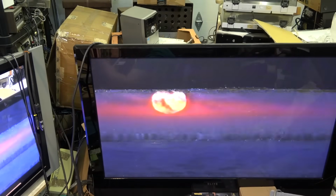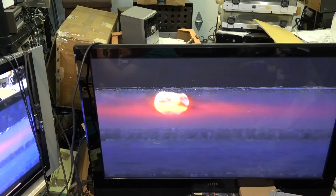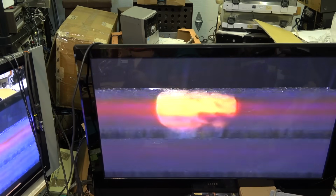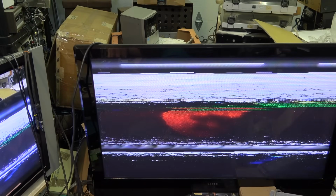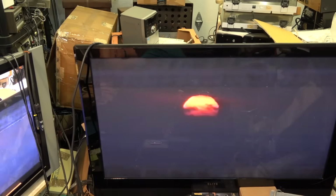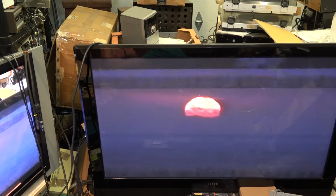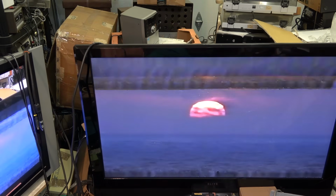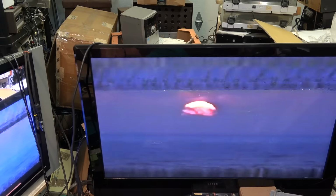That's the clutch, by the way, that's making that noise. I love how it keeps the sound going in freeze frame. That definitely looks like an alignment problem. Like one of the guides is way out of adjustment on this one. Oh yeah, that one's screwed down all the way. Who's been into this thing?